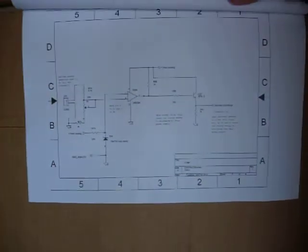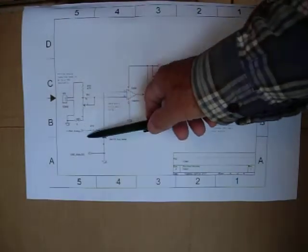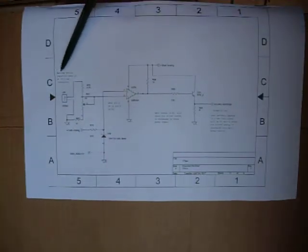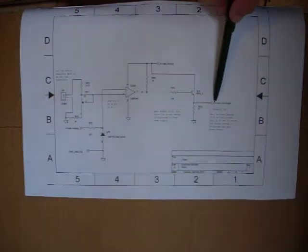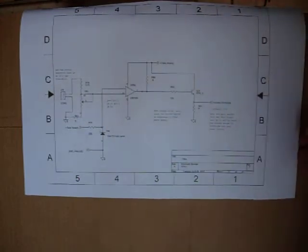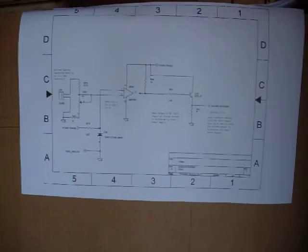This one here senses the level of the recovery voltage. When that reaches a certain level, say right around 12, when the bank is at 12.1, it says, okay, now you're going to take the recovery discharge and put that into those circuits that need to be refilled. So that's the schematics for the big board right there.